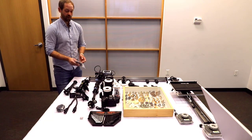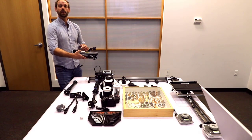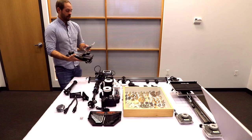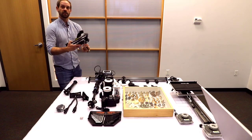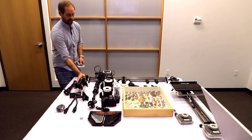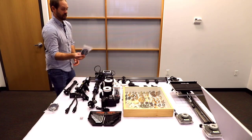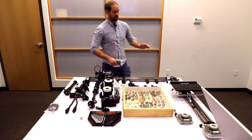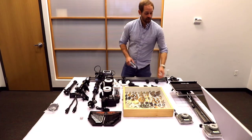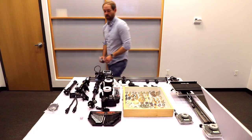The X axis is going to be your focus stacking — that's this rail here. For this system, you have an extended rail, so you have a little bit more flexibility; it's actually 200 millimeters instead of 100. You're going to connect this four-pin adapter to one end of the four-pin cable and then connect this to your X axis. The other one, which is identical, is going to mount to your Z axis. Your Z axis is going to be the actual translational carriage that holds your box, and you'll connect that up to your Z axis on the controller.